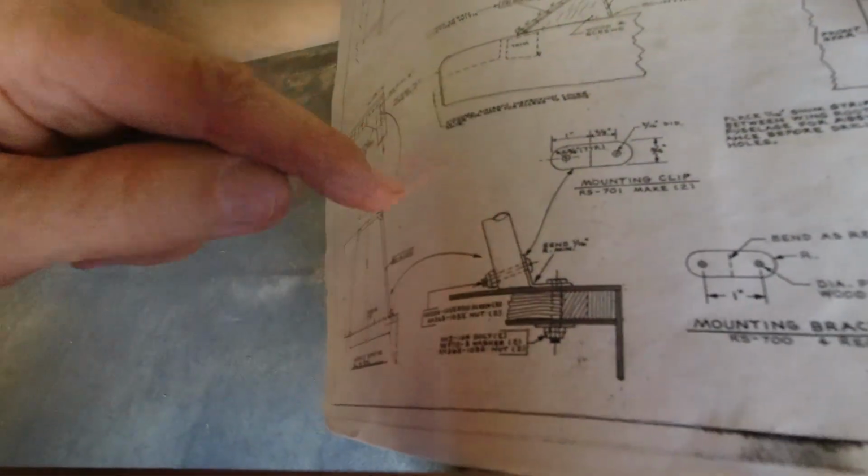But then on the fuselage side, we're actually using a 14A. Yeah, let me get those drilled out anyway. I don't know why I got confused there. It's an AN3-14A and an AN 526 1032R 20. So I've got both of those over here ready to go.